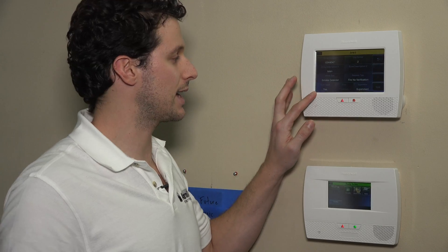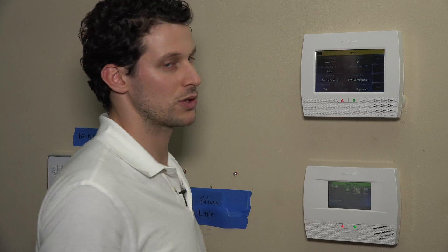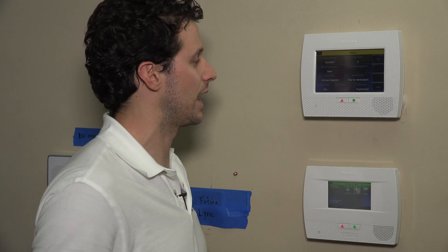We have Alarm Report set to Yes. We always want to report alarms unless you only want a local fire alarm system with no reporting to the central station — for example, if your fire department requires registration or licensing that you don't have. But generally, leave that on so the central station can be notified if there's ever a fire alarm.